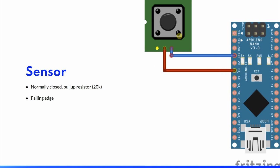When the lid is opened, the switch is released and this will complete the circuit. And this will lead to a rising edge on the pin that is used. Following this, the pin will be in high state and still nothing is happening. The microcontroller is still in sleep mode. But when the mail is deposited and the lid is closed, the pin with the micro switch will enter falling edge and this triggers an interrupt. This leads to the microcontroller waking, measuring the battery, sending a radio signal, registering a new interrupt, and going to sleep.